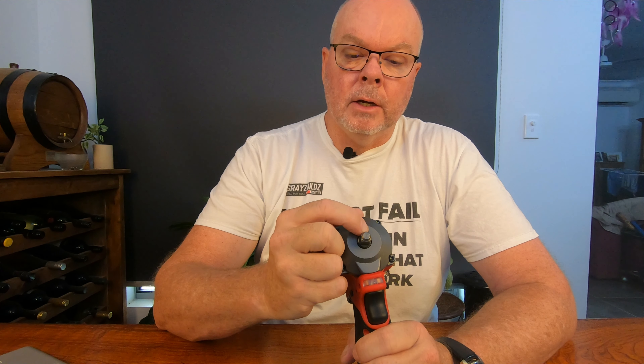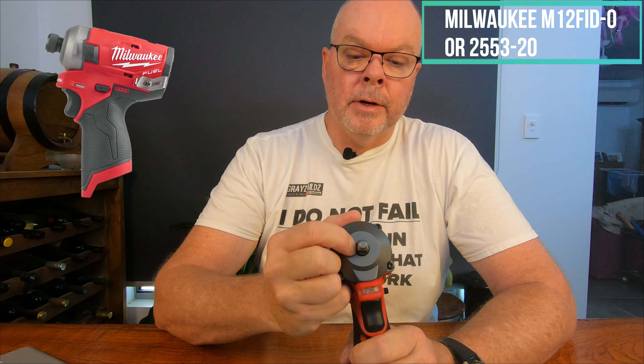Let's get on to this week's tool. I have another Milwaukee M12 tool — I've been wanting this one for a little while now. This is the M12FIW38-0. The dash 0, of course, indicates that it is a skin. Eagle eyes amongst you will go — that looks very similar to another tool that you reviewed before. Yes, it is very similar, but the other one has a 1/4 inch hex key drive in the front. This is a 3/8 inch drive — a subcompact 3/8 inch impact wrench.